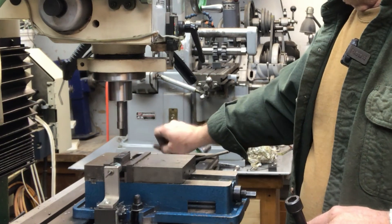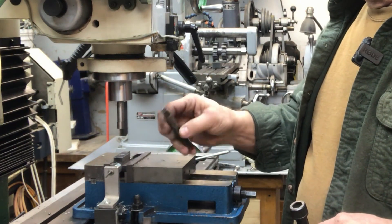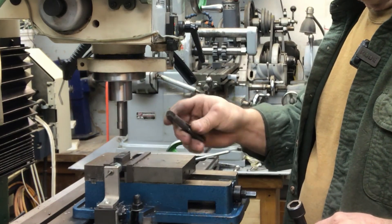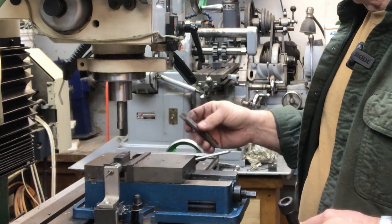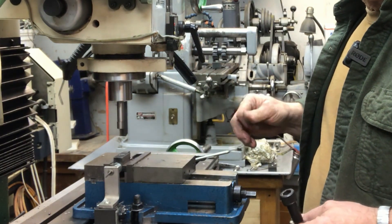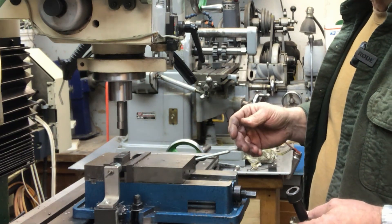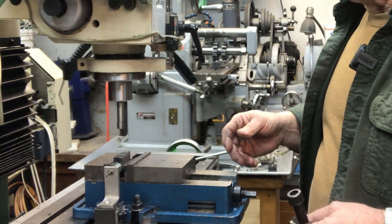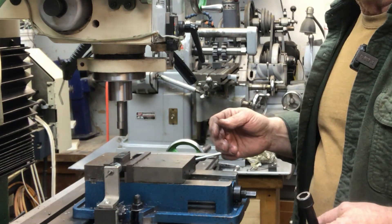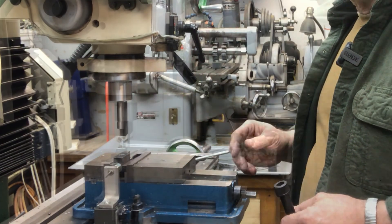Then I'm going back and manually starting my tap hole to get it threaded. I can use this right in the collet with an index head on it and manually turn that in the mill by hand. Once I get that going, I've got another tap set up in a tap handle that somebody shortened up as a bottoming tap — before I got it it was a used tap — and I'm going to finish tapping through with that because it's a little bit sharper.